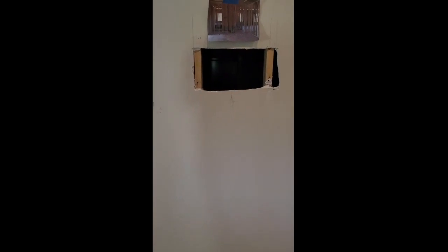I won't have to do any sheetrocking on the outside of this wall — I'll just need to do the sheetrock on the face of the arch up and around, and a little bit on the inside. The box itself on three sides is going to be shiplap siding, so I won't have very much sheetrock to do at all. The next step is to finish my layout and cut the actual sheetrock out of the way so I'll have a finished sheetrock opening on this side of the wall.